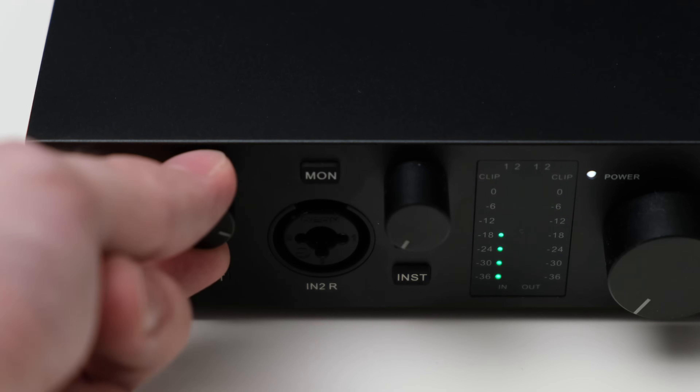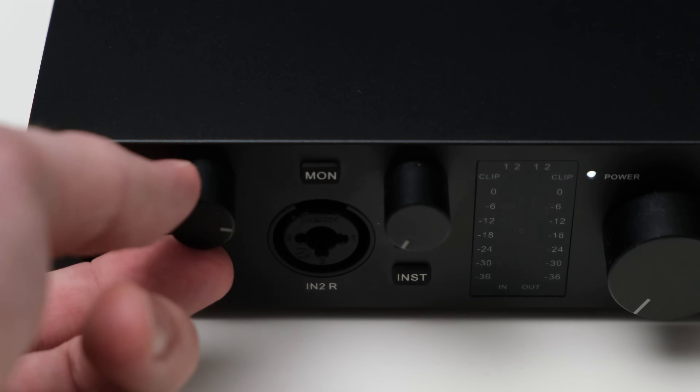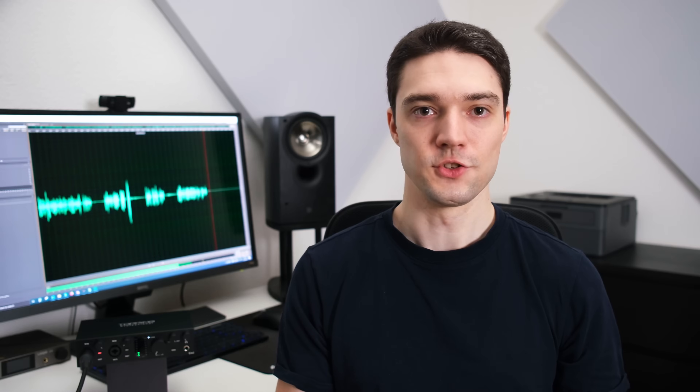The gain dials of the mic inputs are exponential, meaning that in the last 15% of the gain dial it crams in about 20 dB. So when you turn up the gain, the level changes only slowly in the beginning but then towards the top the gain shoots off. This can make it really quite challenging to set your gain correctly with dynamic microphones, as you will be close to the maximum gain and then just slightly touching the dial adjusts it by a couple of dB. There also seems to be a spot on the gain dial where you can hear a slight scratching noise when adjusting the gain. So in terms of usability I think there is room for improvement.